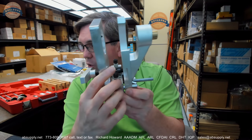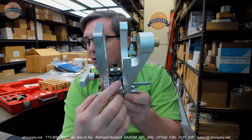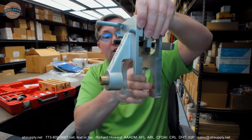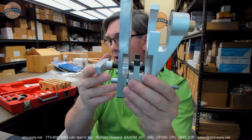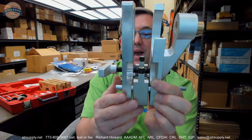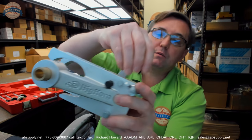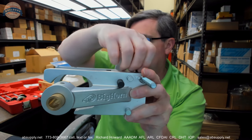These are your back plate and your back plate screws. These are set in position for 2 3/8. If you're doing 2 3/4, you're going to remove these screws so that the unit will fit deeper down onto the edge of the door. This is what's called the center section. Storage holes for backset screws. They have those here. I'm going to remove one and demonstrate. You'll be able to take that and thread it right into the side. No problem at all. That's nice.